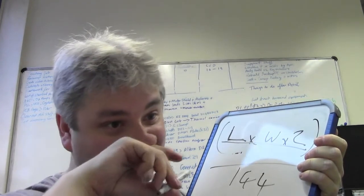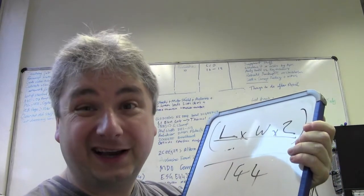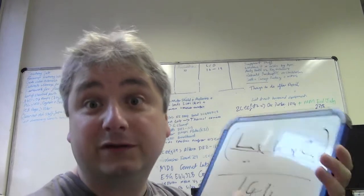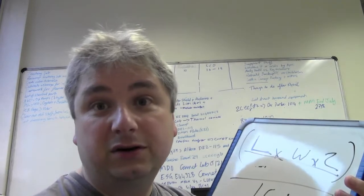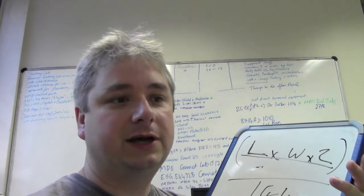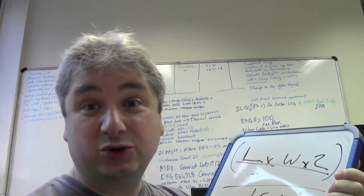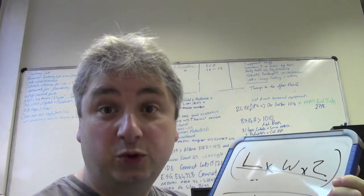Usually you set this to an ASF of about 15. That covers small holes to very large holes, because generally PCBs have tons of holes in them, all different sizes: component leads, mounting holes, vias, through holes for components, stuff like that. What do you choose? If it's set too high, say 25 or 20, there's a good chance that you can seal up your small holes.